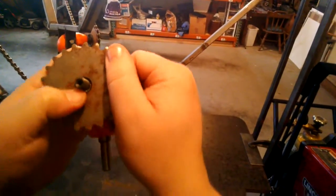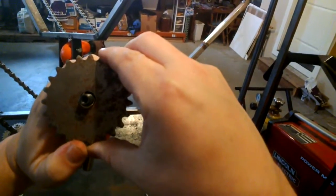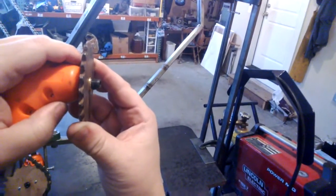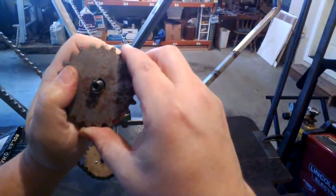How does that look? It's actually kind of promising. This was just a rough cut. I'm going to do it again with longer strips, but I think that's proving pretty promising. They've also got to be narrower, of course, so they don't protrude above into the sprocket so I can clamp the nut all the way down. But otherwise I think this is looking pretty promising. Two strips of brass, short enough that they don't project above the edge of the sprocket, and they're pretty neatly centered. It's not 100% perfect, but I think it is good enough that I can proceed to welding these in place.